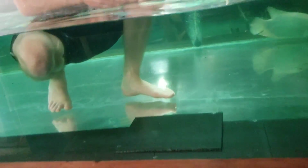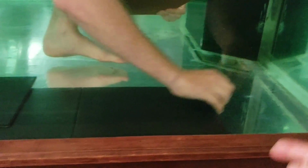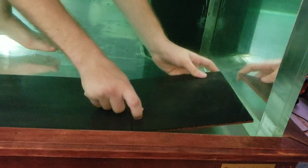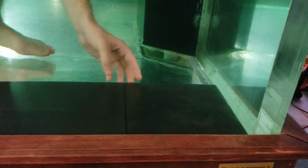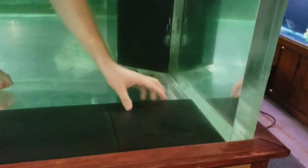Okay, this is the cut tile. Now, one side I cut is this side right here, Josh, towards the camera. This is your factory edge. Put that up to the tile. Put the cut edge against the wall. Just like that. Push all these tiles back first. Can it move at all? That's a great fit.